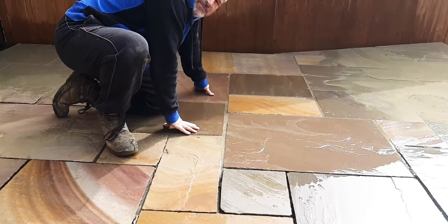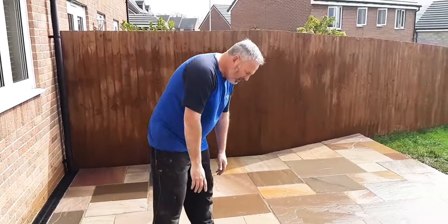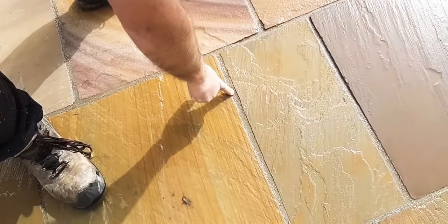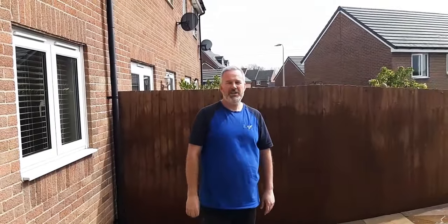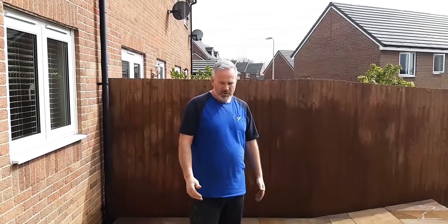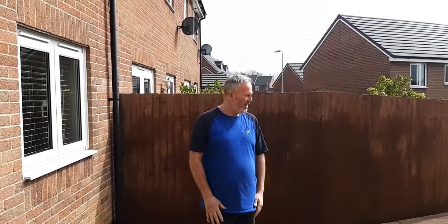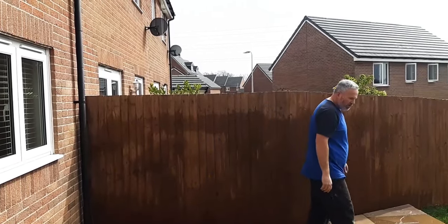So see you then. Here we are then. So we've finished. All the flow point is in. If you get a close up on this now, look, Brad. All the flow point's in. That is absolutely rock solid. And as you can see, since we first started, the hat's come off, the jacket's come off, so you've got to be careful doing flow point in the hot weather. We used what, 4 bags on this, Brad? 3.5. All right, 3.5 bags on this. So there we are. It's all done, and there's no cross joints in it.